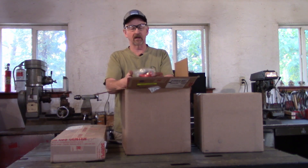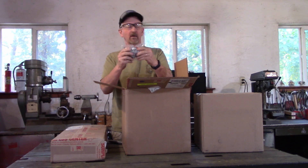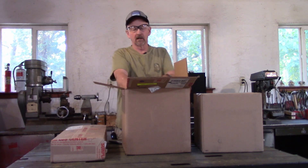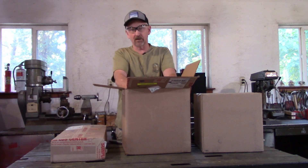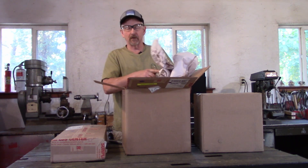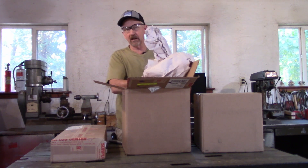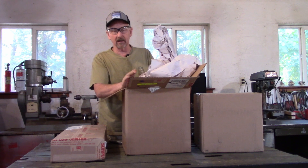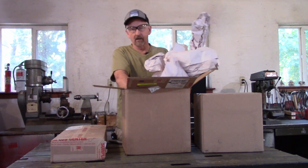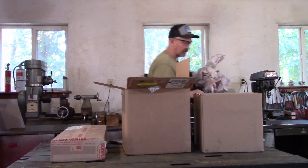This is the top of the oil filter — a suction-side oil filter. I figured it would be safer, and that's what I've been using for years, to make sure that even if there's some debris in the tank, it can't get into the hydraulic pump itself. Cleanliness is very important with the hydraulic pump.